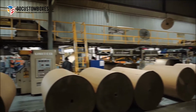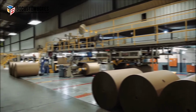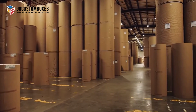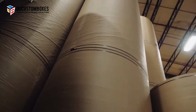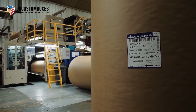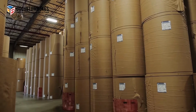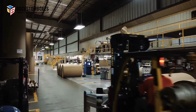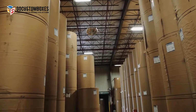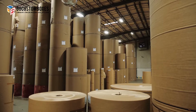A series of sophisticated machines acting in unison to create the corrugated board is called a corrugator. The raw material of corrugated board are the container board grades of paper. Liner, which becomes the flat facings of the board, is primarily made from the long fibers of softwood trees. Medium, which becomes the fluted middle layer of corrugated board, is made primarily from shorter fibers from hardwood trees.